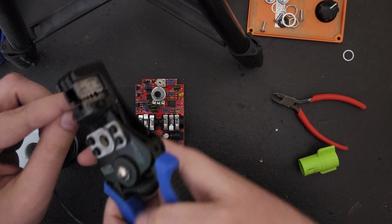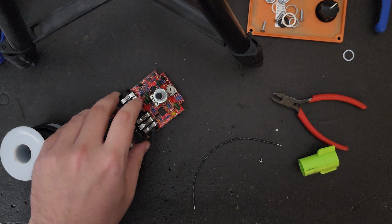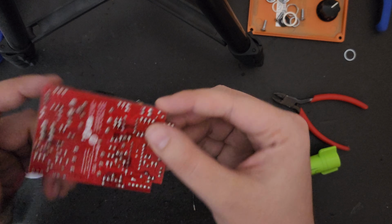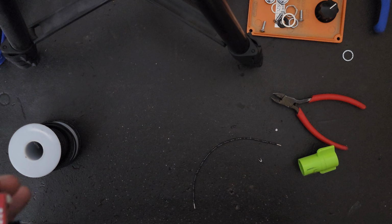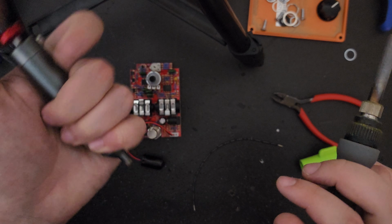So take a short length of wire, strip both of the ends, and prepare to connect it between the board and the switch. So flip the board over to find the hole containing the little bit of solder and the tiny bit of leg from the component you cut, and use a soldering iron to try to empty that as best as you can.